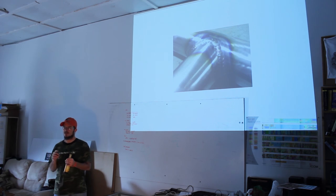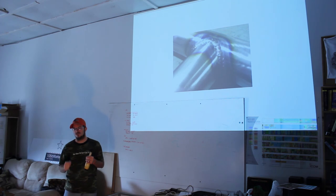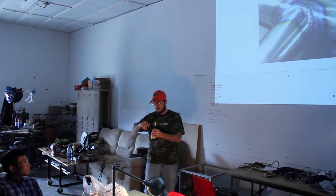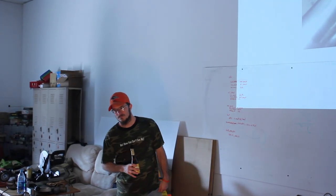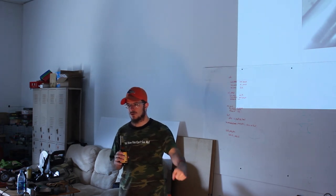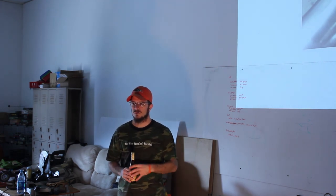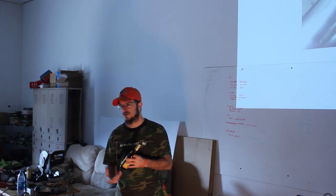Then it's basically like a two-stage oxygen feed. You have a base amount of oxygen that you feed for the flame, and then you have an all-the-way-on, full blast that you get when you squeeze the oxygen lever down. That will give you all that the regulator is putting out. Does that require a separate regulator? No. The torch handles are half and half. You can take off the end of it and put on either a welding tip or a cutting tip. Oh, okay, so they're modular the way they're built. At best, you might want to adjust the pressures on the regulator based on what you're doing, but I haven't had to do that either. Gotcha. Cool.